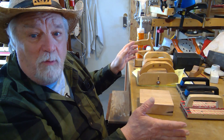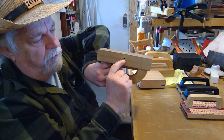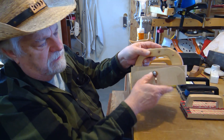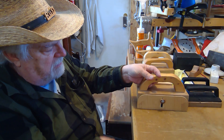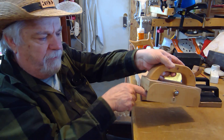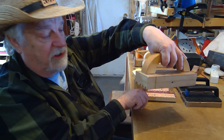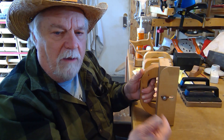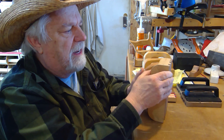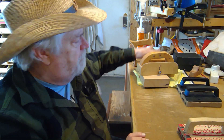The first thing I thought of was making it more stable. The easiest way was to add a side plate. I made this version — it has a threaded insert and a small dado on both sides. I take this piece, cut a slot in it, and it drops down. I set it to the height of my workpiece, lock it down, and now it's stable. But if I had to flip it, I had to switch the sides, which went against the grain of what I was trying to achieve — no moving parts.